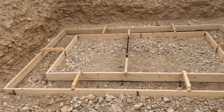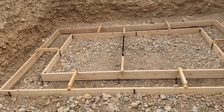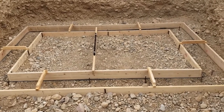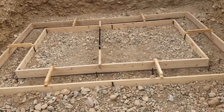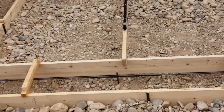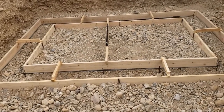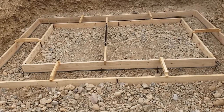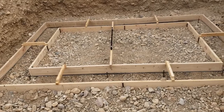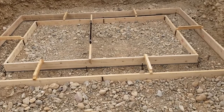The dimensions will be 8 foot wide, 12 foot long, built to inside dimensions. Those footings are fairly wide but will support 1-foot wide foam blocks stacked 8 foot high. We're going to fill those footings full of cement, then stack the blocks, and put half-inch rebar on 1-foot centers horizontally and vertically, then fill those blocks with cement.